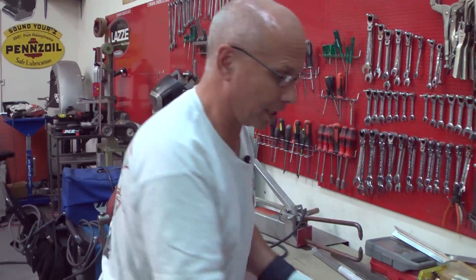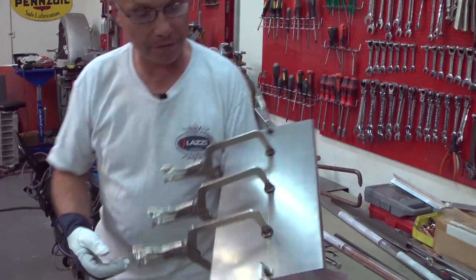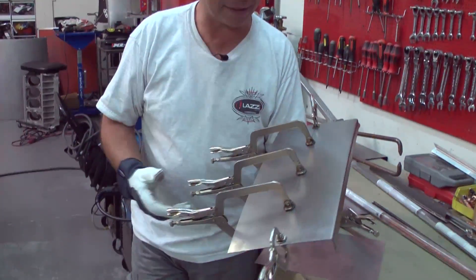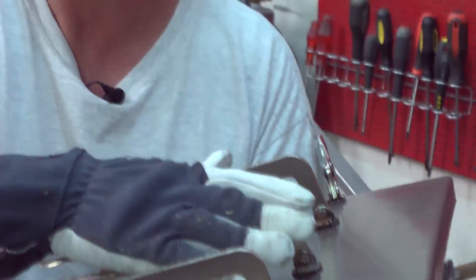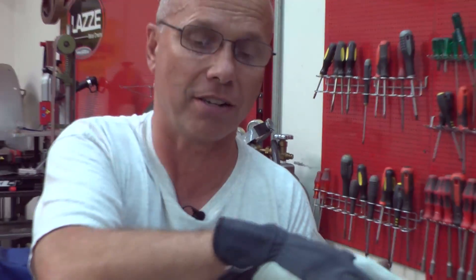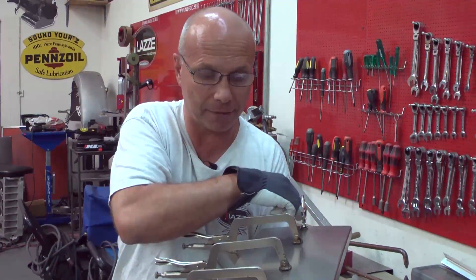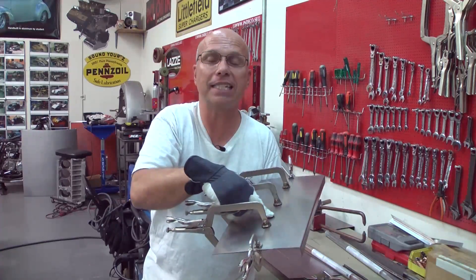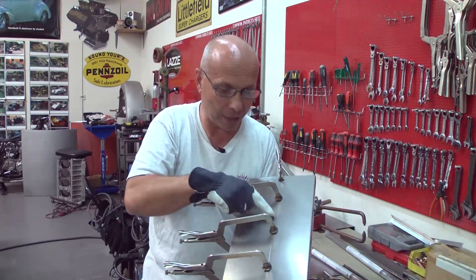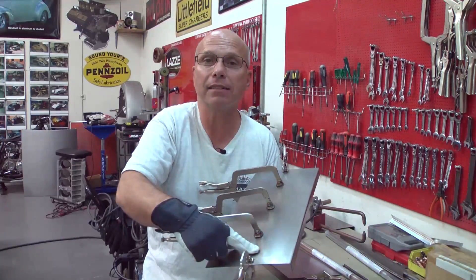Here I'm going to show you the best preparation you can do. I've done a test piece so you can see. I rolled it up in the English wheel so it has a little convex shape. Then I bent this edge so I can put it in the vise when I weld it together. After welding, I bend it in the brake and cut it with an electrical shear — one cut. Those two pieces fit together perfectly with no gap, just tight together.